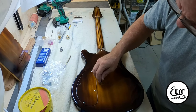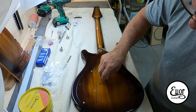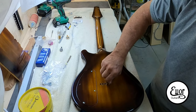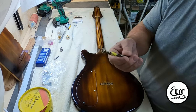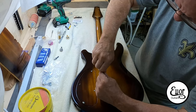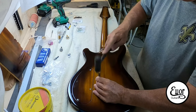Whenever I'm doing my final assembly, I like taking a chamfer bit and going around all the holes, cutting the finish where it dripped down into those holes and cavities. It's simple — you use it by hand and cut the finish off. Then I'll go back with the full-size drill bit, whatever the hole was, and clean it out. You want that finish out of those holes for sure.